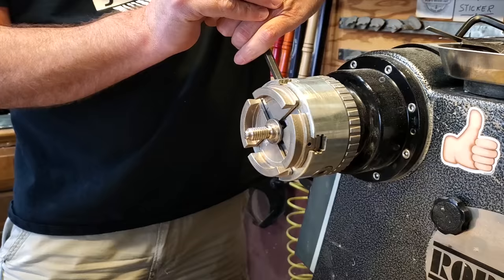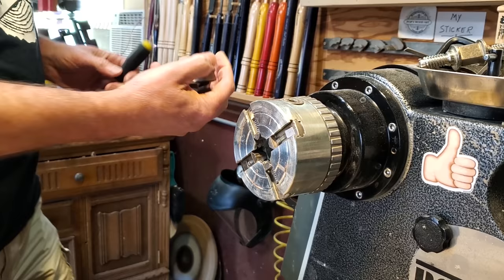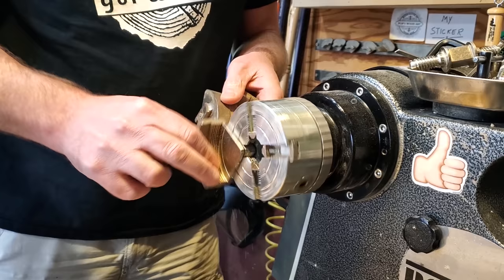This was a pretty large piece. When I started out it was 24 inches and after I got it shaped it's about 22 inches. It's still pretty big, so I made a large tenon and then used the large jaws to hang on to it while I cleaned out the inside.